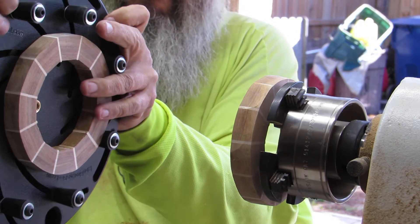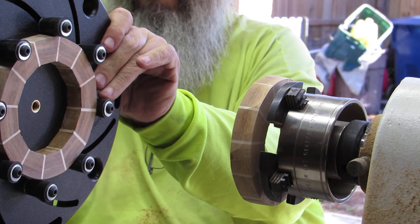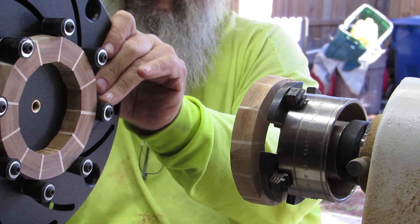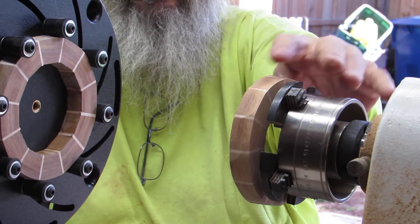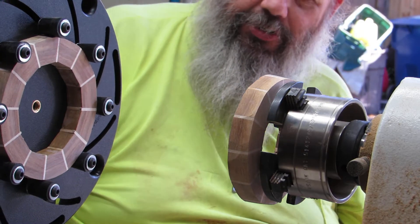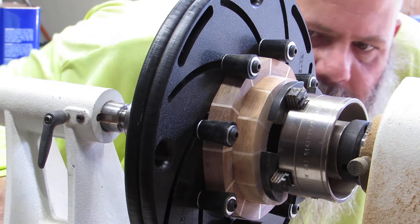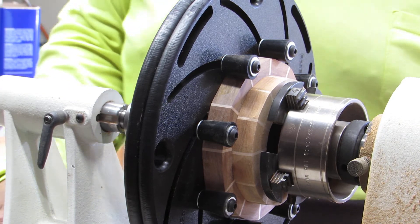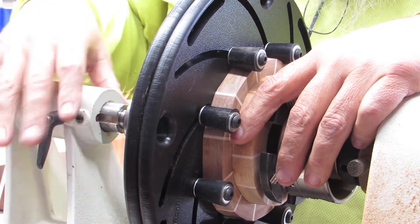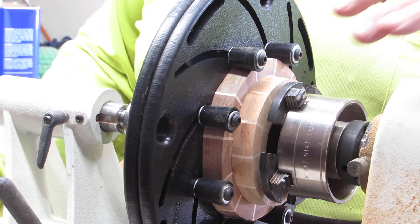Trying to stay out of your way. Now it automatically is centered. I'm just going to tighten one or two of the bolts. I have this mounted on — it's just set on there loosely on my chuck, just for demonstration purposes only. And look how easy and how perfectly centered my rings will line up now without any problem. I'll just mark my halves, find my half points, mark them, lock my tail stock down, tighten her down, and we're ready to go.